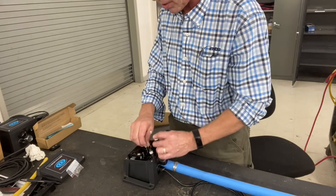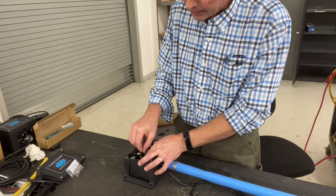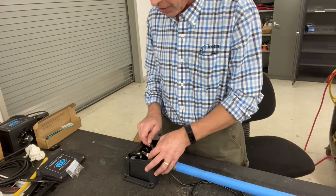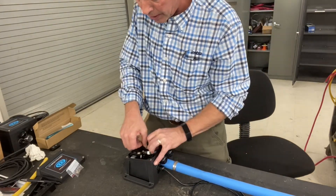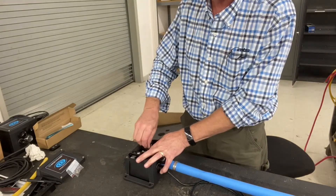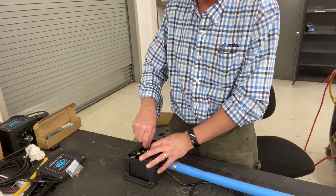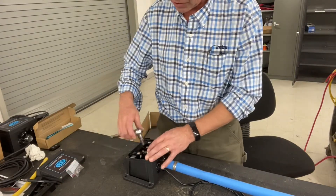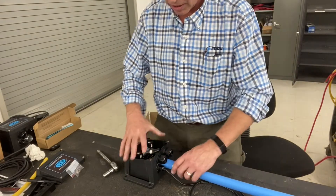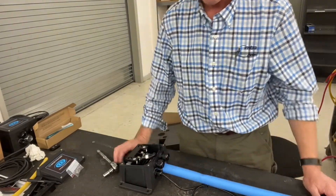Then we've got A1 and A2 — put A1 on, then add a lock washer and a nut. These are high amp loading connections, your A1 and A2 power feeds, so it's very important they are secured properly and torqued. You must have your lock washer in place, your nut in place, and torque these to 4 newton meters. Your battery feed cables — positive and negative — must be torqued to 5.6 newton meters. These are 10 mil fasteners. Then put your hose clamp up and tighten it in place. Mount the box in the boat and that's basically it.